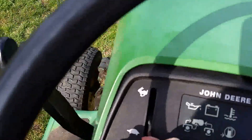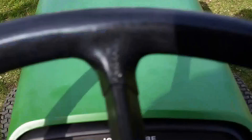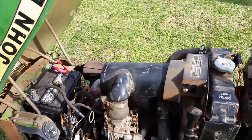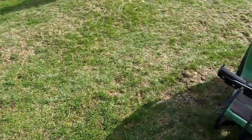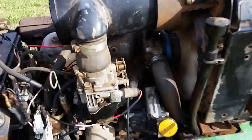The idle needs some work. If you've watched videos on 322s or seen them run, they do have a hesitation when you manipulate the throttle quickly. As you can see, the engine will hesitate. There's a delay, and that's because this carburetor lacks an accelerator pump. What an accelerator pump does is when the throttle linkage is depressed, it spurts a little extra fuel in there to accommodate for that delay. That's why this thing stumbles — it takes a bit of time to get the extra fuel up there when you hit the throttle. Otherwise it runs really well.